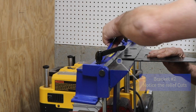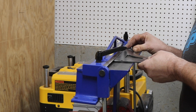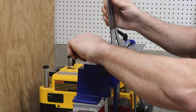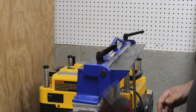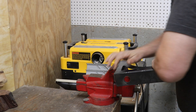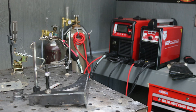I just have a small brake from Eastwood. As you can see on this bracket, there are the relief cuts. This is the actual second set of brackets that we made. I'm bending it up using the Eastwood brake, and then once I had it bent a little bit, that second part I bent by hand — it was pretty easy.